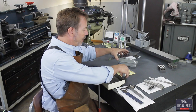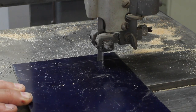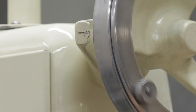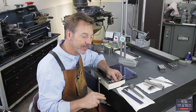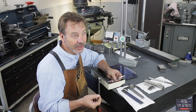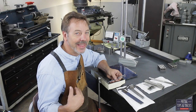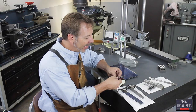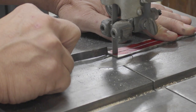This one's designed for more force. What I ended up doing was cutting off a wide strip here, twice the width I need. This material was too thick, so I prepped it on the surface grinder, thinned it down — pretty easy process. Flipped it over, cleaned up the other side, then I measured it, put it back down, and saw that I needed to go 22 thousandths more to match the original thickness of the first spring. Quick coarse cuts — they don't have to be super accurate as long as I get it down to an approximate thickness. Then I took the wide strip, cut it in half on the bandsaw, and now we're ready to go for the next step.